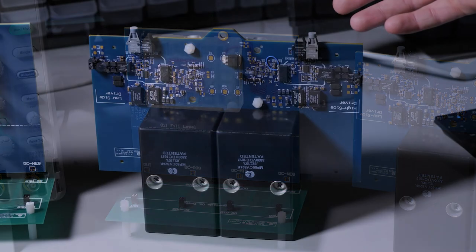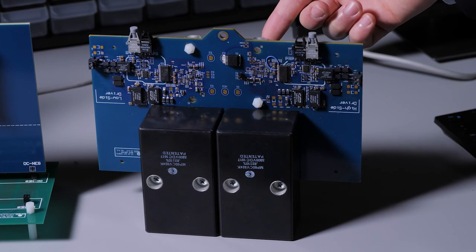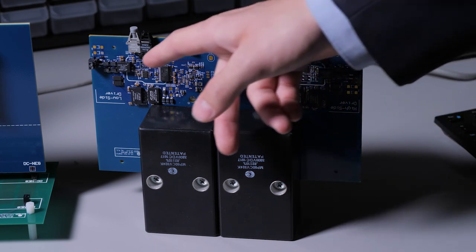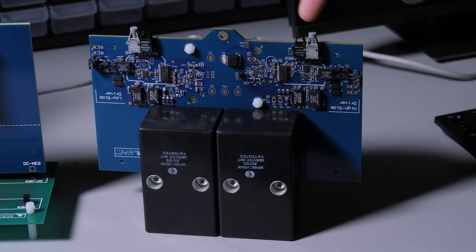Here is the completed bus bar integrated into the gate driver PCB with the power module mated to the bottom. The PCB has onboard decoupling capacitors on the DC bus, gate drivers for both the high side and low side devices, integrated short circuit and overload protection, and fiber optic inputs for the control signal. The gate driver is set up for a double pulse test to dynamically characterize the power module. A capacitor bank is used as the source and an inductive load is attached to the output. 16 kV rated isolated power supplies are used to power the gate drivers.